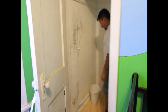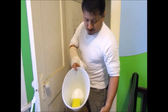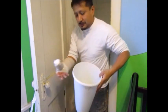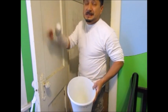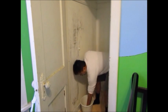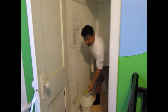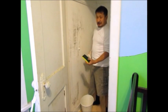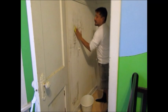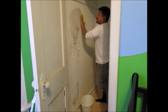One thing I want to show you: when I say one-third bleach to two-thirds water, you don't need to fill the bucket all the way — even for a big section. Just use the bottom of the bucket. I'm using a green scrubby. After scrubbing with the bleach solution, I'll just throw the scrubby away — you can get them from the dollar store. You don't want it dripping wet — watch your floor — and you can see it cuts right through the mold. Then I'll leave it set for about 10 minutes so the bleach can kill everything.